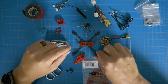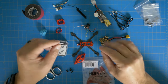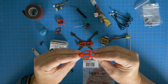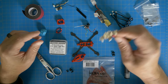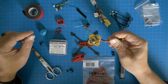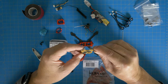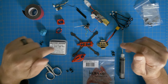Special shout out to Sam at Excel Drones — he hooked me up with all the parts and gave me the idea for the build. I can't be more happy with the Pyro Drone and the rest of the components. So let's get started. This is the Gnarly FPV Primo toothpick frame — you can get this on Pyro Drone, it's about 20 bucks for the kit. It comes with a lot of options: different battery mounts, different camera mounts. This is the Pyro Drone F4, the all-in-one micro ESC and flight controller running BLHeli S, 12 amp, supporting two to four S.